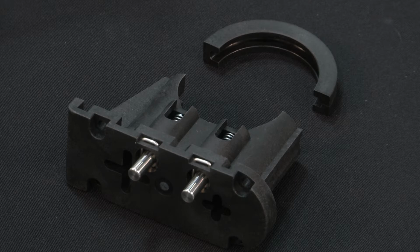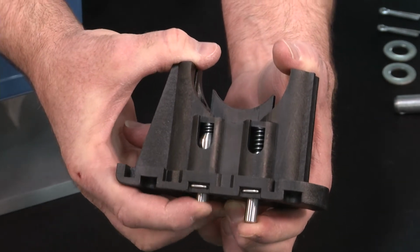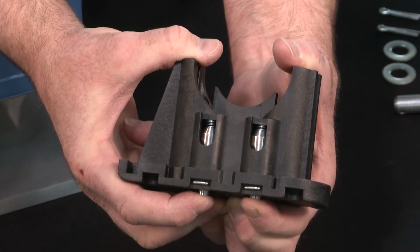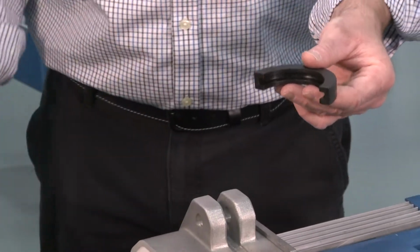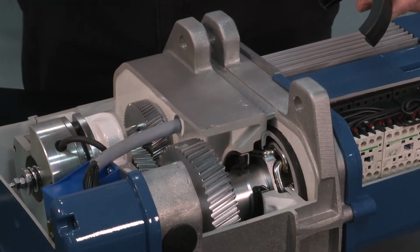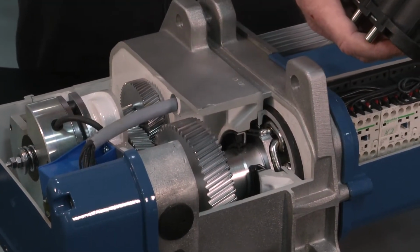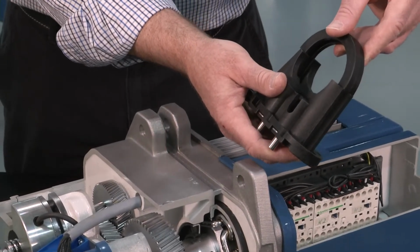And you'll notice, and we'll talk about this when we take the other hoist apart, these are the limit switches, and they are actually not the switches themselves, these are limit switch actuators, and we'll talk about why that's important in a few minutes. But this downhold is this piece right here, and that match set like this completely encompasses that chain throughout the whole travel through that pocket wheel.